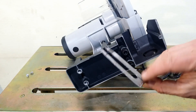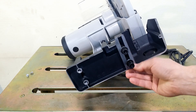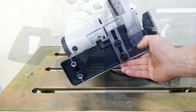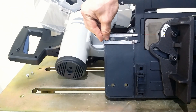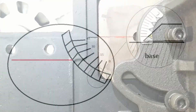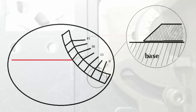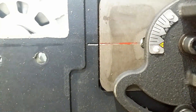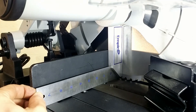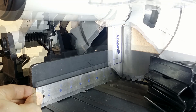I cut a shim to correct the tilt. The shim is long enough to distance the two castings all along at this spot, and it will touch the base here. Is anybody from Evolution watching this? Guys, it would be better to go gradually at a little slope to the red set line — when it is distanced like this, it is hard to align those two. No gaps with the shim in place. Sweet.